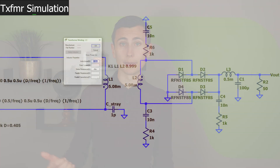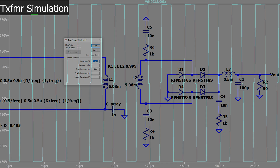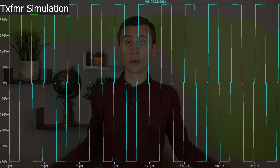If we're driving this transformer with ideal waveforms and there are massive voltage transients, ringing, or other nastiness, I want to know now. I pulled in the most critical parameters — magnetizing inductance and the ESR of our windings — and estimated our leakage inductance at approximately 5 microhenries, which is 0.1% of our magnetizing inductance. With an ideal waveform of 450 volts bipolar at the correct duty cycle and a resistive load, I measured 2.6 kilowatts from the pulse generator and 2.44 kilowatts reaching the load — an efficiency of 93%.